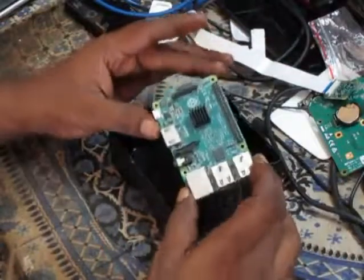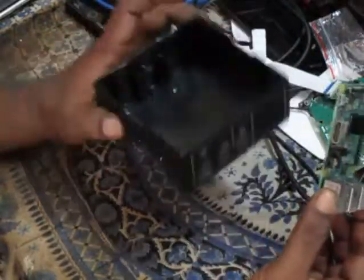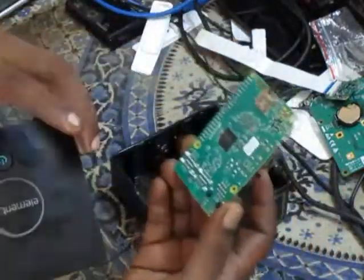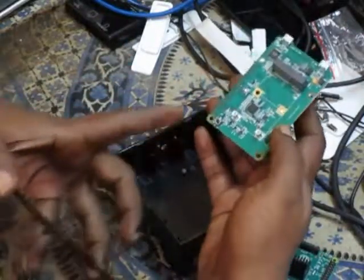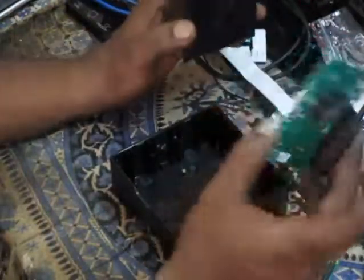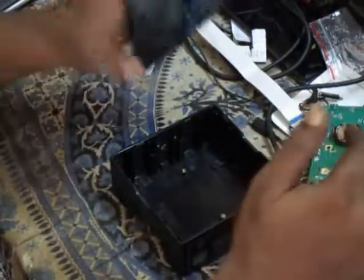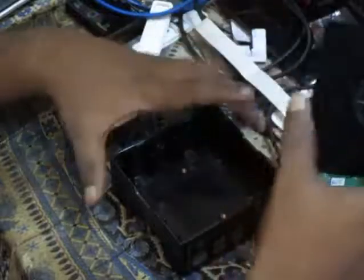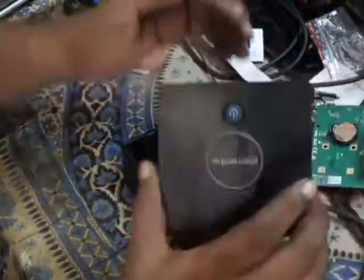I am going to install the Raspberry Pi 2B onto the Pi desktop. This is the Pi desktop frame and this is its cover. It has a switch here which depresses another switch on this board. Depressing it triggers reboot and such functions. Once a software package has been installed onto this board, it activates this switch. We could install the Debian package which is meant for this switch, but we have to install it first onto this board.